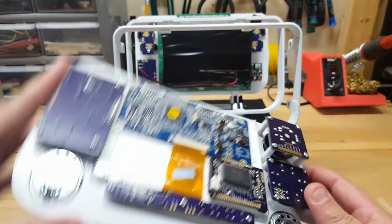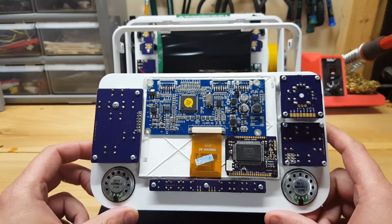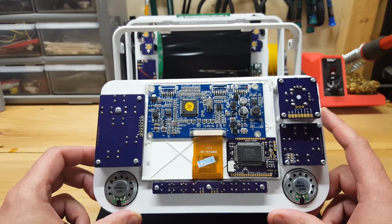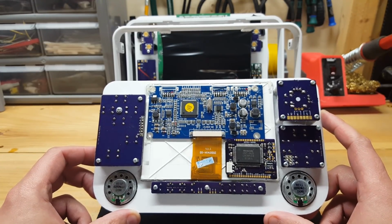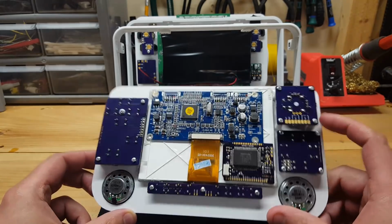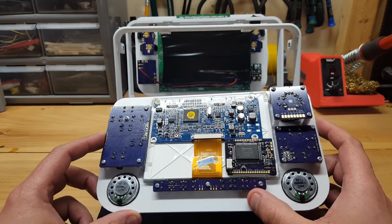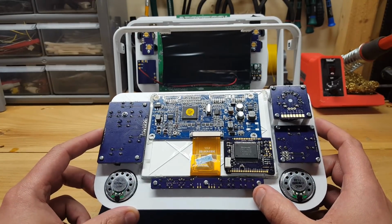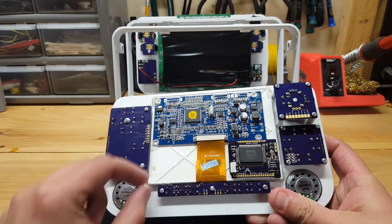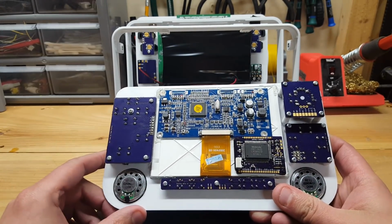On the back side of it, which is what's cool about this exploded display, you actually do get to see everything inside here. You've got the custom circuit boards that RDC made up for pretty much every main component in this system. Now you've got the PS3 joystick breakout board, the D-pad breakout board, the B A C button breakout board, the new updated TAC board, which for the screen that will be shipped with the kits, takes away that little button board that comes with the screen, so it's actually built right into this TAC board, so you don't need to have that additional board in there anymore.